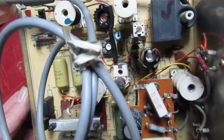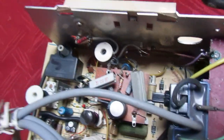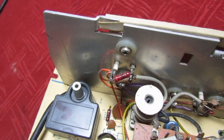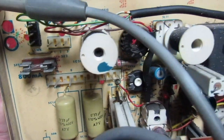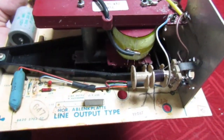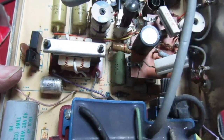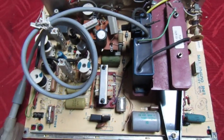For that reason I'm not going to plug this in until it's stood for quite a while in a very warm place. You can see it's in very good condition. These look like the line flyback tuning capacitors, and there are two transistors under there - I think they were BU108s. It looks like they've been replaced at one time. The fuse is okay. I'm going to dig out the service manual, leave this to climatize for quite a while, and then we'll have a go at plugging it in and hope there's no major disasters like last time.